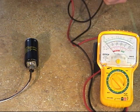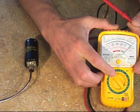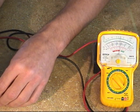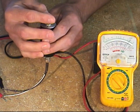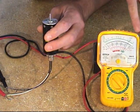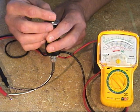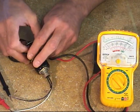Next, we're going to do a little resistance check with an analog meter. The first thing we'll do is zero the ohm scale. Set to ohms times 1 and zero the scale so it reads correctly. We'll preserve our correct polarity and do a resistance check. Same drill — turn it just a tenth of a turn and watch. I'm seeing about 50 to 100 ohm variation here, which is not great. What I'm looking for is one clock position that is greatly different than every other clock position. These are all very similar.